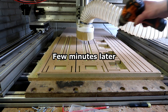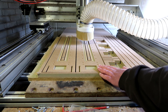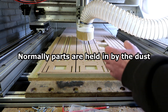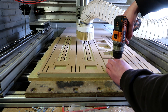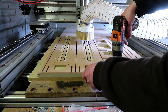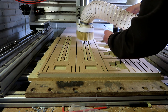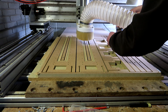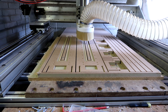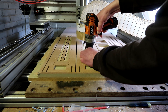When doing a recut, it also clears all the dust in between the cuts. Now some pieces are really left floating, like the ones sitting here - I really do not like that because if it gets caught it could mess up your whole design. So next time I'll just cut deeper than I actually need to, just to be safe and cut it free in one go. I love this MDF - cuts like butter.